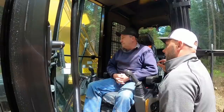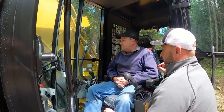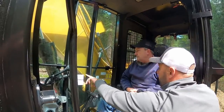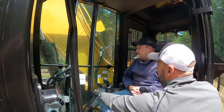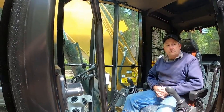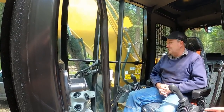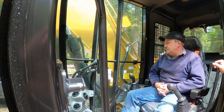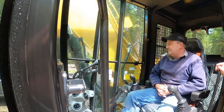It's going to ask you right now, auto warm up ready. You're going to say yeah if you want, no if you don't want to. So if we hit this and say yeah, it's going to say put the bucket on the ground. We already know it's on the ground. Machine's going to idle up. It's going to put it into hydraulic relief, warm up that oil to 131 degrees, take itself off, and it's basically like stretching your legs, right? Once it's done, it's off and running.